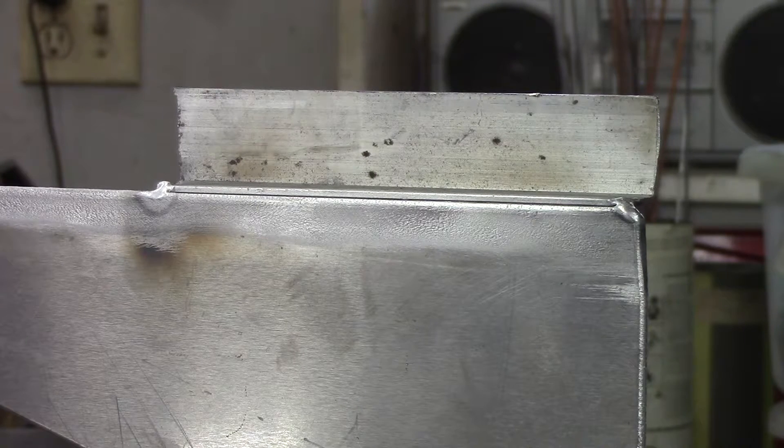Even though this works, it's not very controllable. If you want a good weld, I recommend AC high frequency square wave — it's the only way to go. You need at least a 1/8 inch tungsten, possibly a 5/32. It's going to ball up on the end because you're not on square wave — you're welding at 60 Hz — so you end up with a balled-up tungsten and a fairly uncontrollable arc.